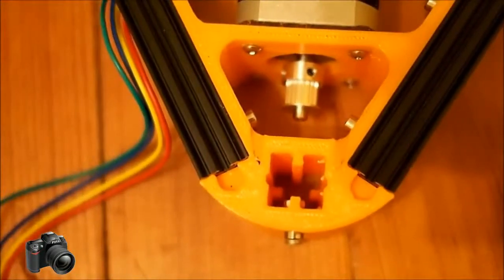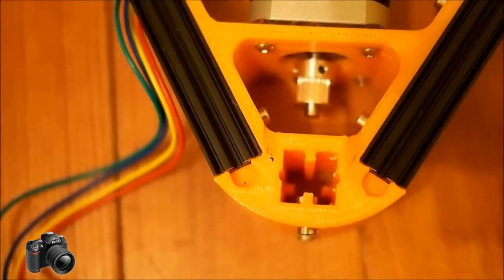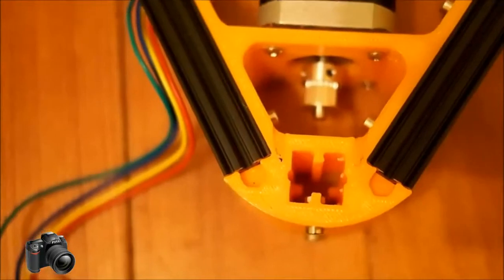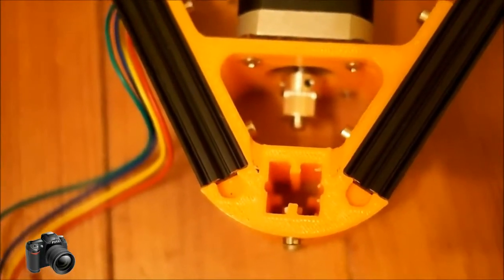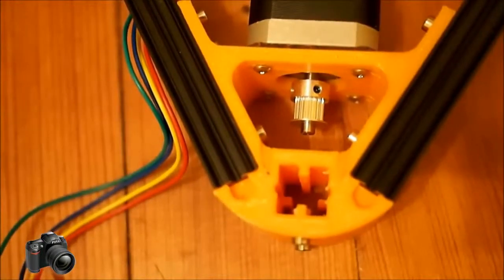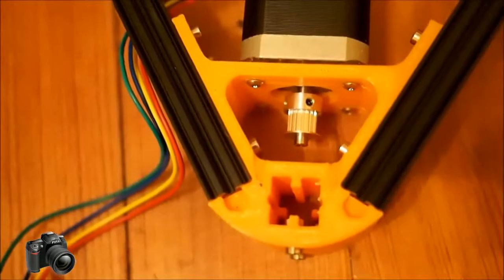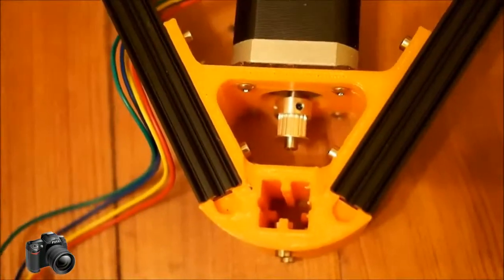If you do that continually and just keep working it in, don't wiggle it too much, except maybe a little to get it out, because you don't want to enlarge the hole or wallow it out at all. You just want to clean it up. Any prep or cleaning that you do on those four corners is going to save you a lot of hassle installing the beams. You don't want them to wiggle, you want them nice and tight, but you don't want them to stick going in, and when they do stick because they're grabbing material, you want to back it out and clear that material before you continue.